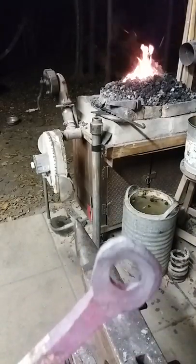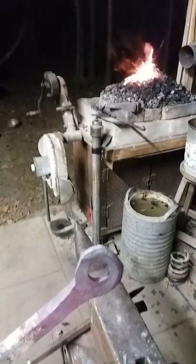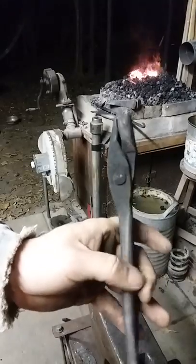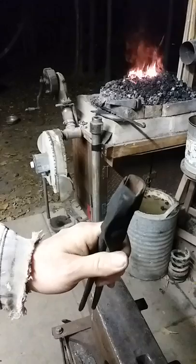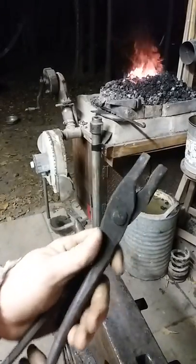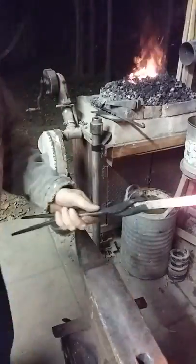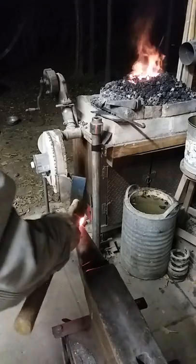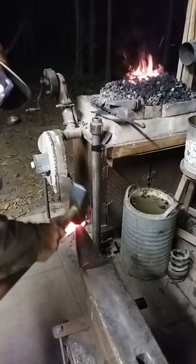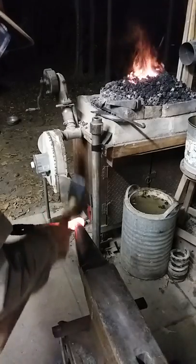So I got the hole this big. What I'm going to do now is heat it up and work around the horn of the anvil and try to get this material spread out into a thinner band. I'm going to grab the spike out — I've made these square jaw tongs out of railroad spikes a great deal of time ago. These are square jaw tongs because they have square jaws. I try to distribute the material based on need — start the thicker portion, kind of lay that out, rotate it, keep it kind of uniform as best as you can. It takes practice.